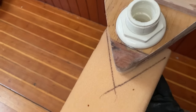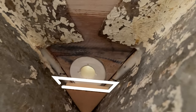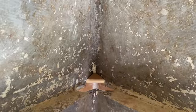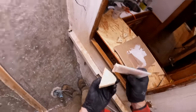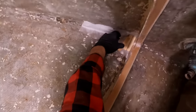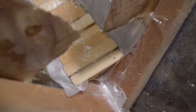The first thing that I want to do here is make a nice floor that slopes towards the drain at the exact right level. Now I wanted to end in a really thick piece of fiberglass, but below that I need some support. So we're gonna cut out some foam in little concentric pieces that get gradually smaller and form to the shape of the bottom of the hull. This way I can easily make each piece as I work my way towards the bow. Once I have all these pieces put together, I can glue them up and we can shape that into a final wedge that will form nicely to the bottom of the bow and create a great platform to lay up some new fiberglass to build this wedged, angled floor piece. That's what we're working on right now.